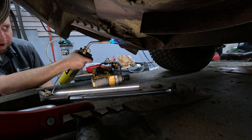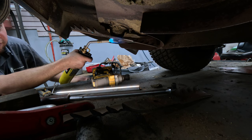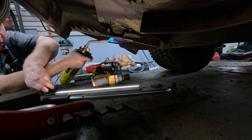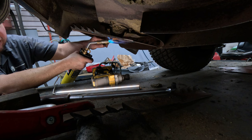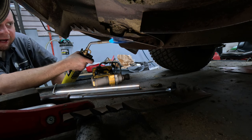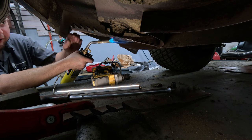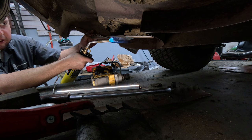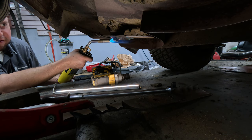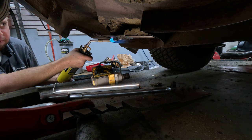What I'm doing is slowly rotating every little bit, getting the whole outside of the nut heated — you want that whole outside edge all the way around heated up. You can use propane on this, but the problem is it doesn't heat as quickly, so everything heats up at once and it'll heat that whole shaft at about the same rate. We just want the nut to heat up, not anything else.